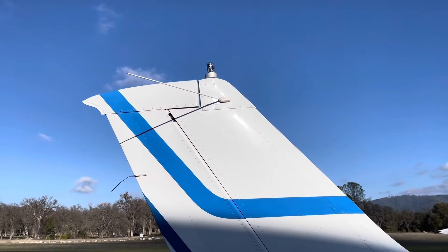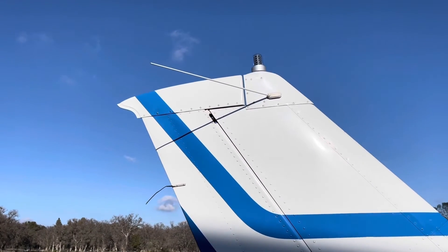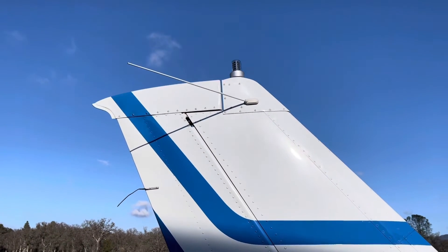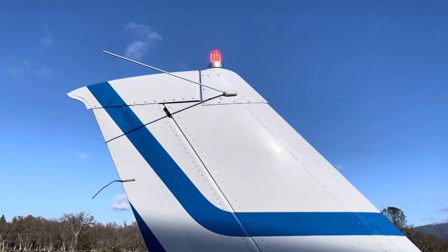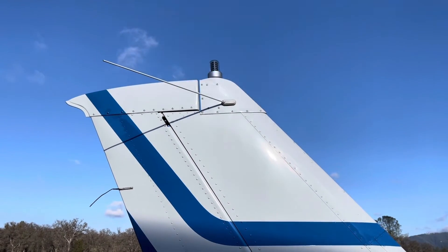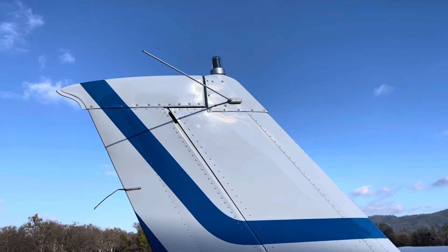That sure looks good. We double-checked our work, went through and made sure all our hardware is back, cleaned up the cart and all our tools, and made sure there were no extra parts — well, there were plenty of extra parts, all the stuff we took off. We took the parts we wanted to keep for inventory and put them into used inventory. We recorded the aircraft times and we're going to do the paperwork last. This is the kind of work that an owner can't do himself — it does require an A&P.